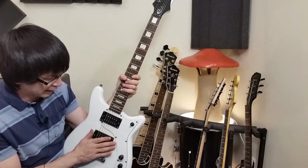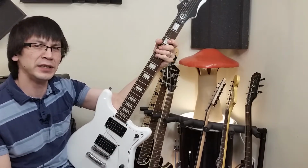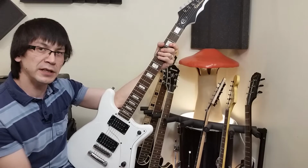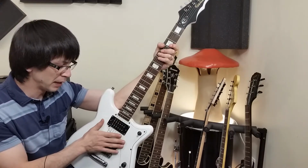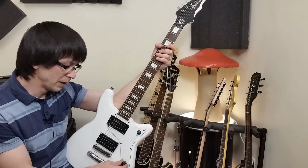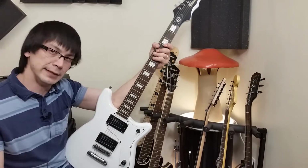And it has Gibson Explorer pickups out of an older Explorer, so it has the vintage braided cables coming off the pickups. I've wired it Gibson '50s vintage style with a volume and tone per each pickup. I didn't give it a master volume though. What I did do is give it a push-pull, so you can control how much mix of the series that you get.